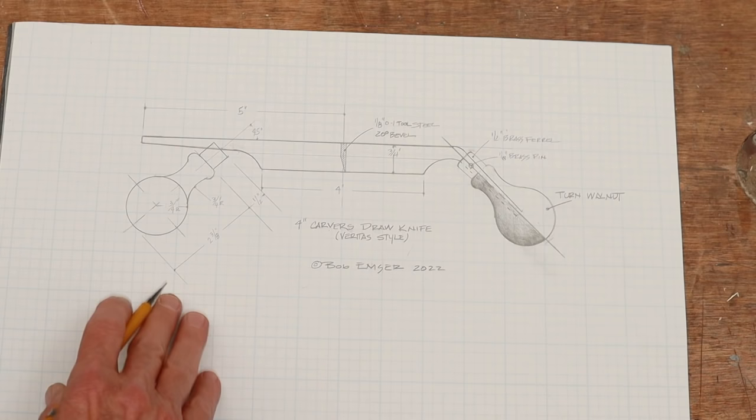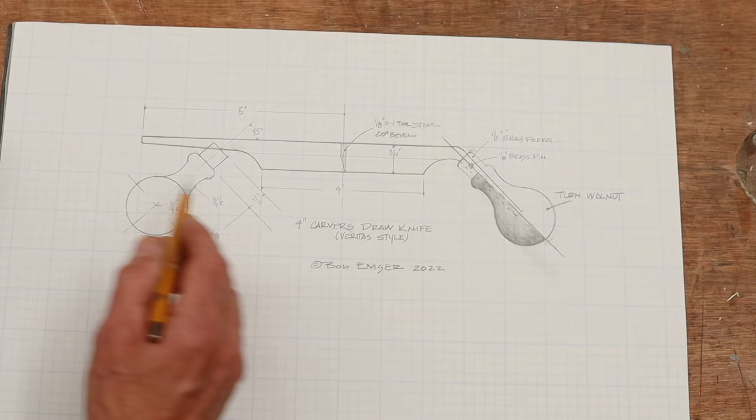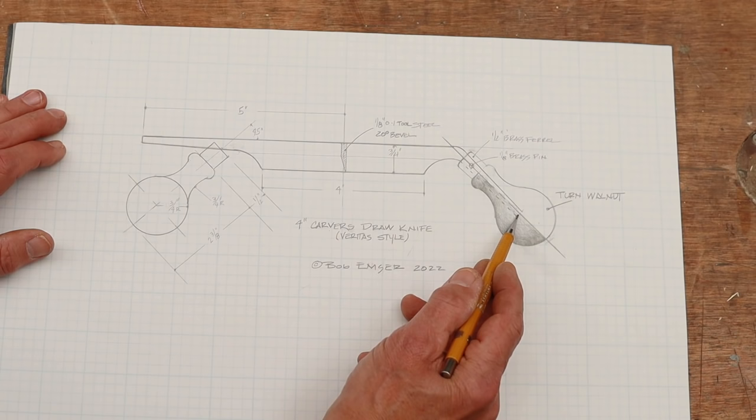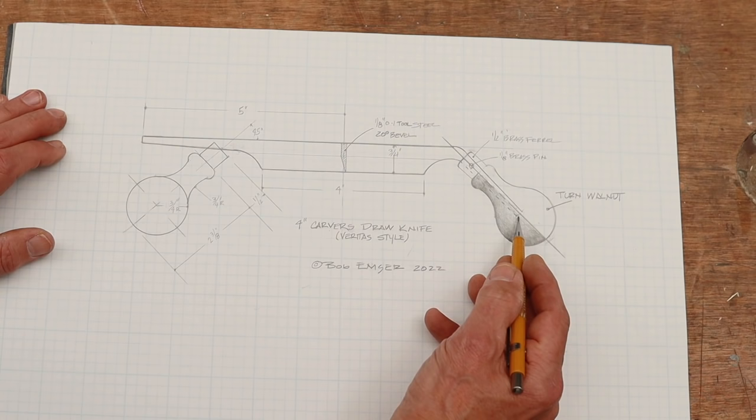So because the steel is only 10 inches long, I thought, well, I'll cut and put a tang on each end of it, and then I'll heat this up and I'll bend it at a 45 degree angle, like it says in the description of the Veritas draw knife.